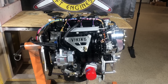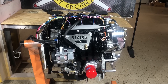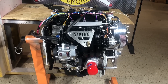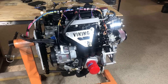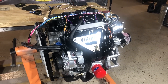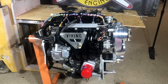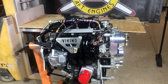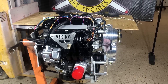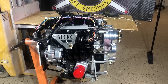It doesn't use any external oil tanks. It doesn't have air-cooled cylinder fins. It doesn't use an exhaust system with multiple tubes going to different places — it's just one exhaust port. It's a very clean, simple, easy-to-work-on, modern engine that doesn't cost a lot of money. So it is in fact a replacement and competitive engine to the Rotax 912.